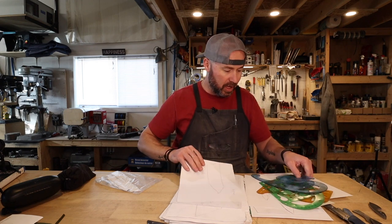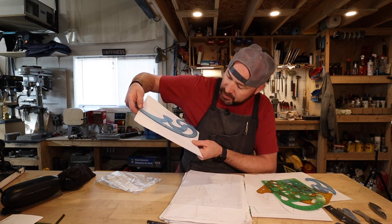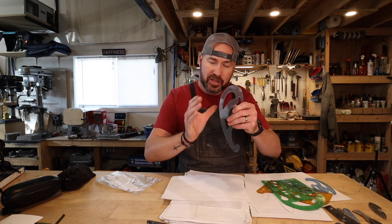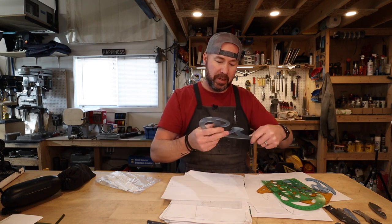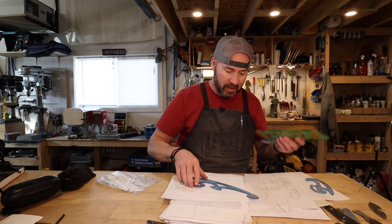You can use the bottom of a coffee mug sometimes, but I don't draw all my knives freehand. For example, part of this kitchen knife template — I'm sure this line would match up very well with this French curve. These things are very valuable in getting the right, even curves. This curve gets progressively steeper, so depending on where you want the tip of your blade, the point and the belly — if you go back here, it's a very gradual, soft belly, whereas up here for a small EDC or skinny knife, you get a much quicker belly. Very, very handy. This is actually a Crayola — a little kids' drawing thing for drawing airplanes — but little things like this make a big difference.